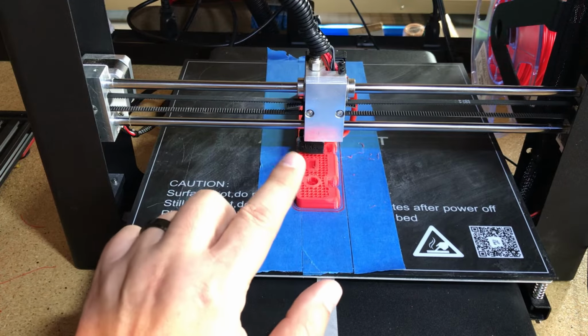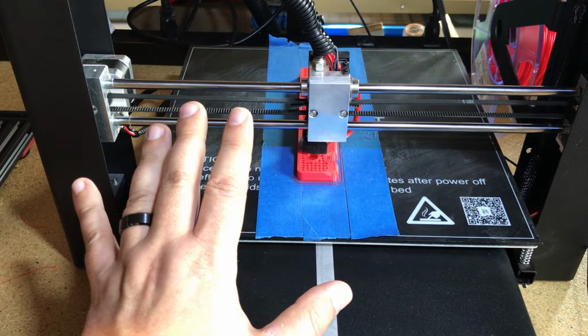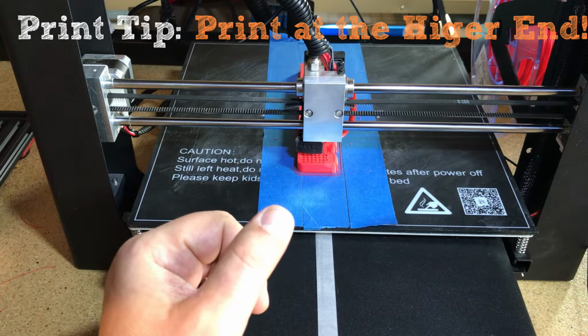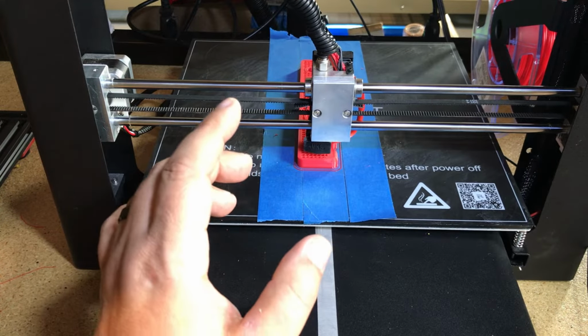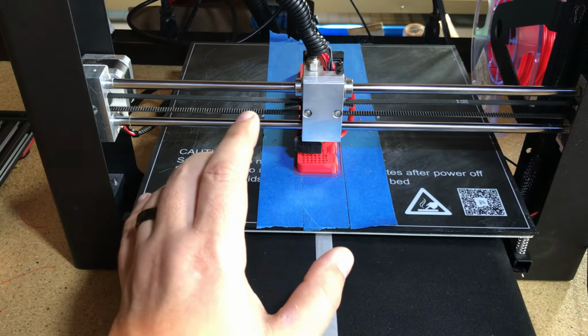Because the other piece is, you notice I have a silicone sock here. I'm printing this at 240 degrees C. PETG is typically a very viscous plastic, so it takes a fair amount of heat, I should say, probably not a lot of heat, but you also want to keep it within a very tight temperature range to get a good result, and this helps.